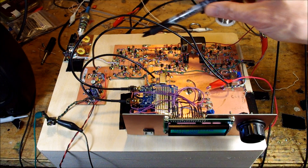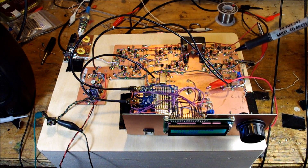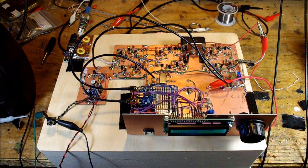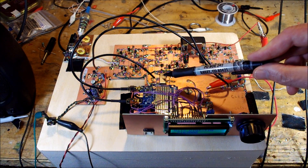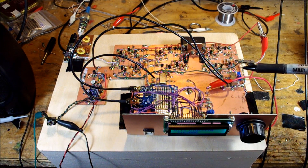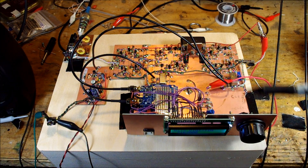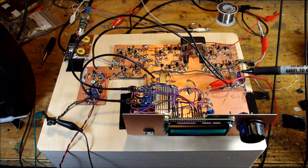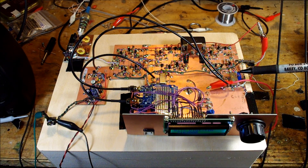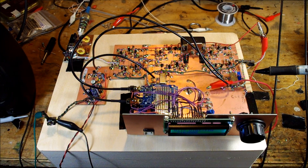Down here, this board is the main board. We have three Termination Insensitive Amplifiers, or TIA amps, developed by Wes Hayward and Bob Kopchi. And I'm using two SBL-1 mixers — this one for the VFO, and this one for the BFO product detector. This one you'll see here is the 100 ohm pot; it goes between pins five and six. This is the innovation introduced by Pete Giuliano and mentioned in Experimental Methods for RF Design.